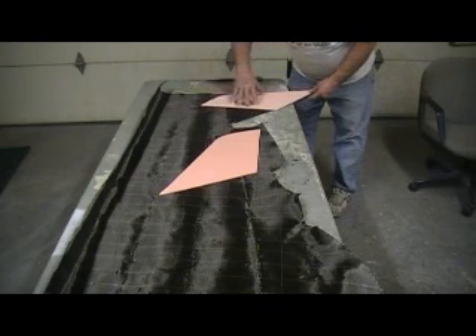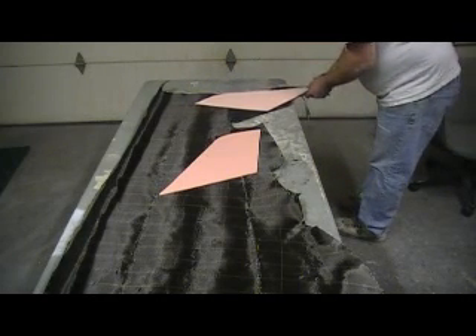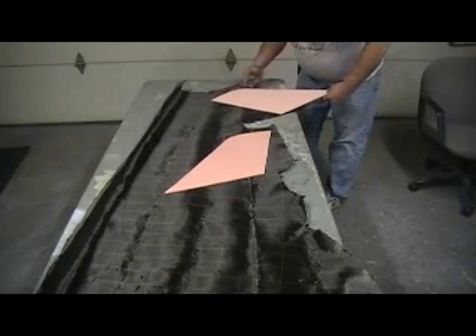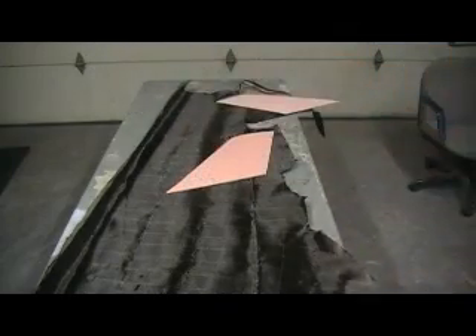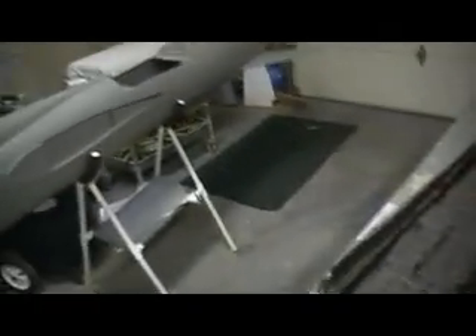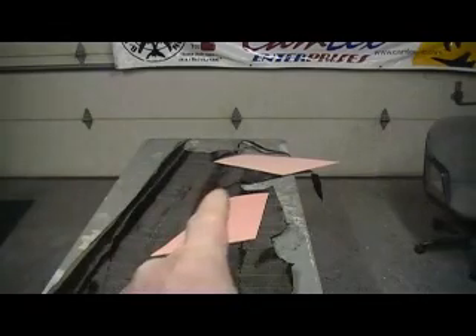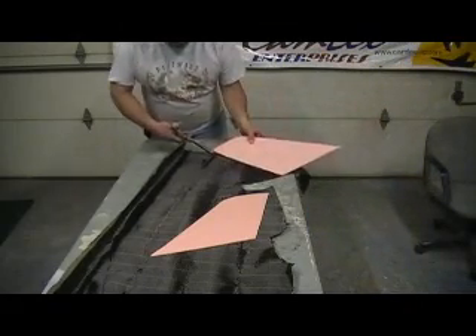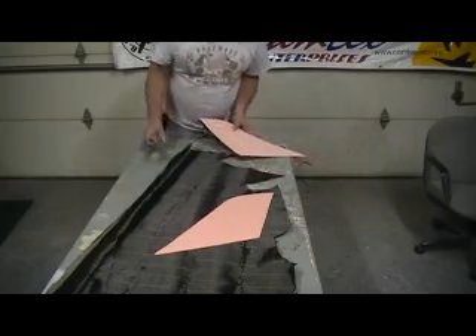This worked out nicely — hardly no lace. I'm going to get these other stabs laid up today. Then I'm going to start going ahead and get my bulkheads all glued in while I'm waiting for this other carbon to come in. I can go ahead and glue all them in now. As soon as my servos get here, we can make this bad boy come to life. After my other wing is built — hopefully that carbon should be here in a few days — we can do some taxi testing.